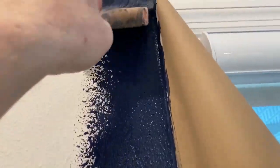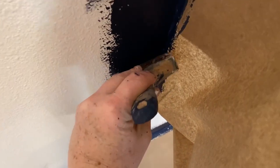This was the other alternative, by putting the caulking against the tape and then just painting it, just like that. This is the window, but the same idea would hold. You caulk it and you can go a lot faster. This is the other side of the window where we caulked it. You see, I'm doing 2 coats, always 2 coats, always 2 coats. And you finish in one direction, right? We go back and forth so violently because we have this texture. I mean, we don't want to take all day, but then you finish, look at that, one direction, right?